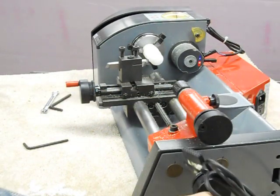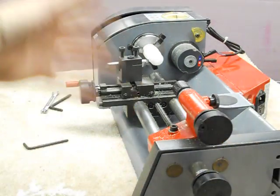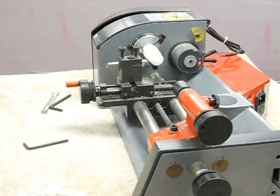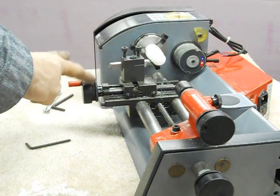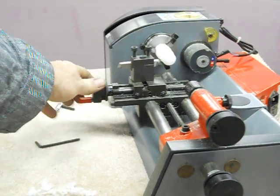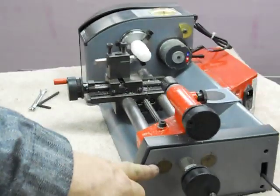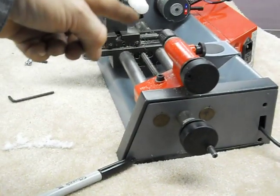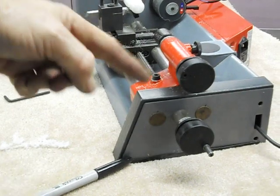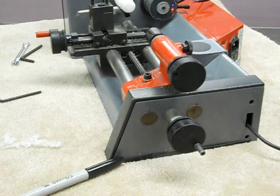It also has a spindle position sensor with a feedback loop that comes out here. The lathe can be set up for CNC control — there's a motor that attaches to the hand wheel by a belt and attaches to the carriage. You can take the mechanical lead screw drive out and run it off an electrical signal; it controls a stepper motor.